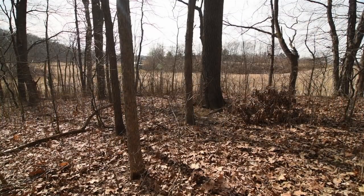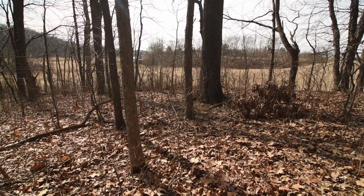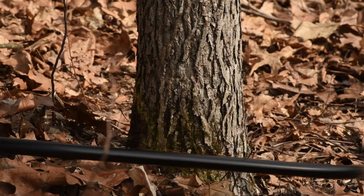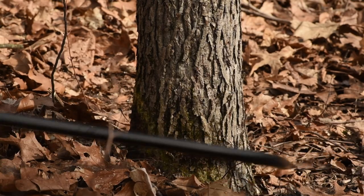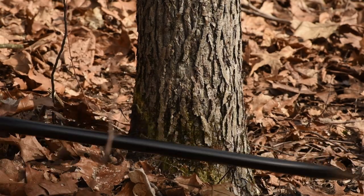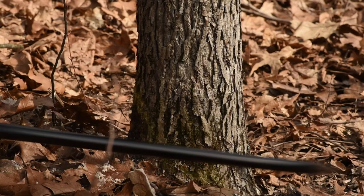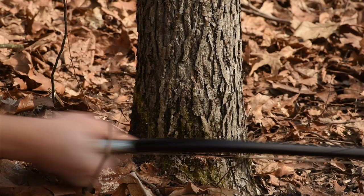The desirable size comes down to what tools are used and how much you want to sweat over splitting out staves. I do prefer not to use trees that get very far below three inches in diameter. Typically the curvature of the tree is pretty tight, giving the bow's back a high crown, which concentrates areas of stress and lends itself to a greater potential for limb failure.